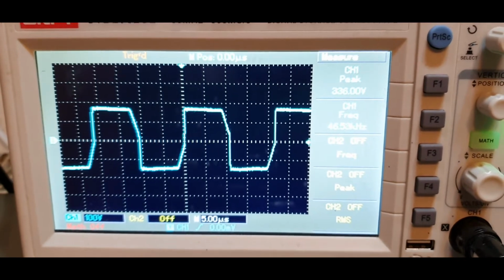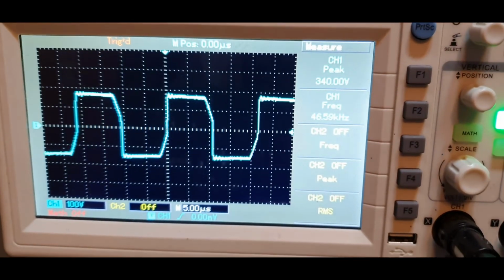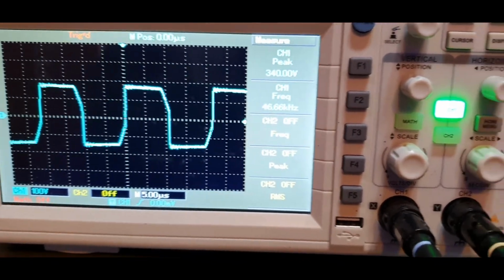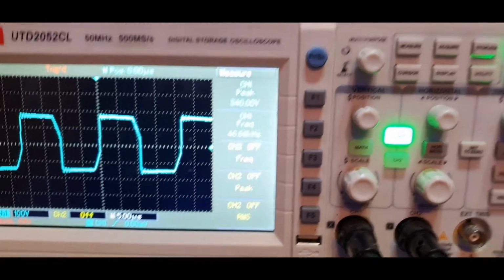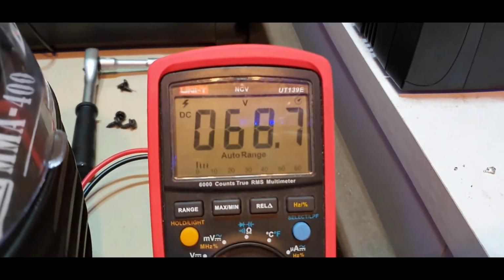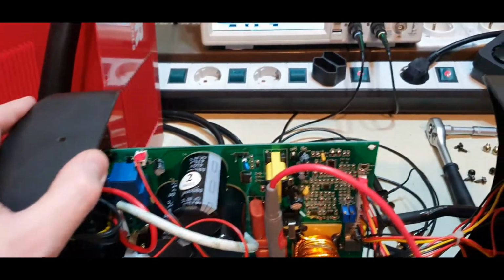Roughly 350 volts peak to peak on the transformer side, and the frequency is 46 kilohertz, and open circuit was from 68 to 70 volts. And in the next video we're going to make a load test.